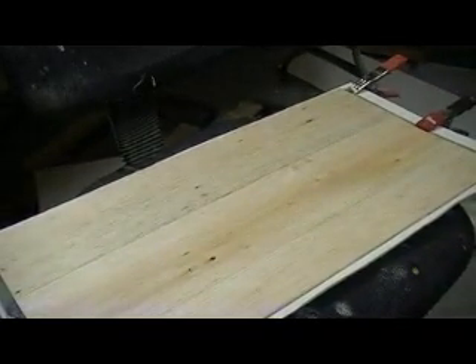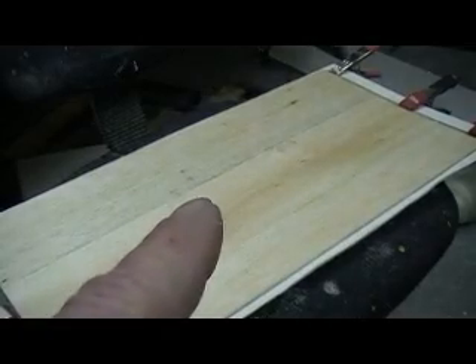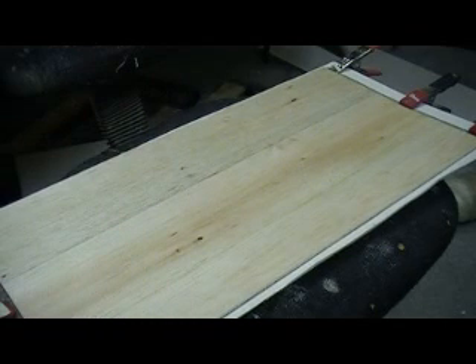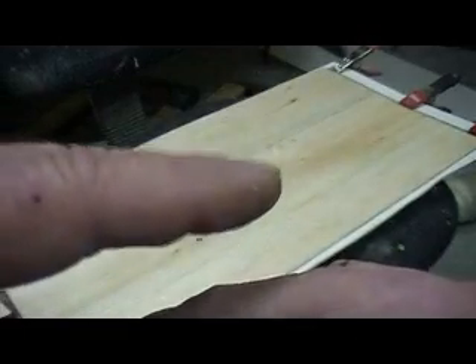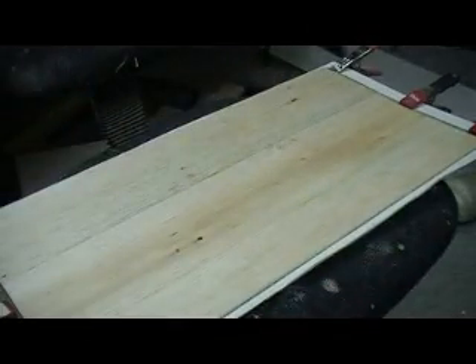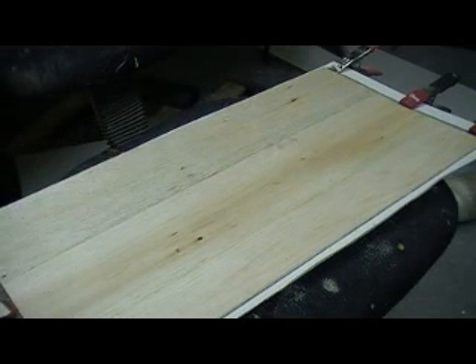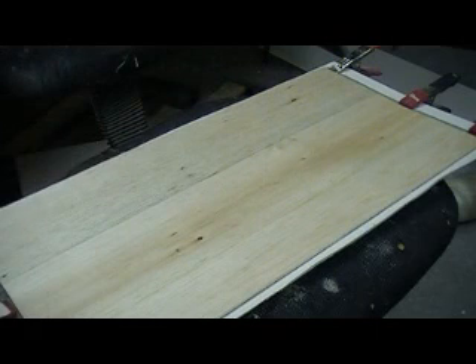What you have to avoid is using too much resin at one time. We know it's going to soak into our wood and into our fiberglass. The trick is getting that happy medium. If you put too much resin on there and don't scrape it off very good, thinking the wood will soak it up — it won't. What it'll do is make that glass float on top of your wood. A lot of times that's where them little ridges come from. And anytime you get puddles of resin, it will set up faster there than where you got it thin. You'll see ripples and when you try to work them out later, it just don't work.